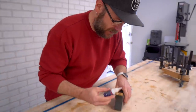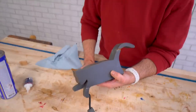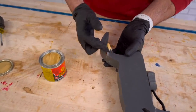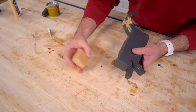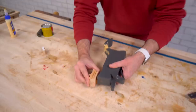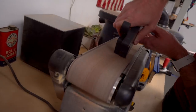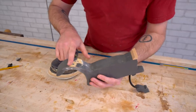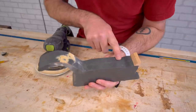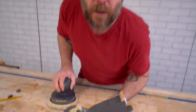I'm noticing I made this out of cherry and then painted it — things were different back in 1992. I'm using plastic wood to fill that in, instead of adding putty that's just going to chip away. So I'm going to sand that down flat and I glued up a block that will glue right in there to cut a new ear — sort of like an ear transplant. Now we're going to sand off some of this wood putty. 25 years ago I did a terrible sanding job; I'll leave all the little flaws in there so mom can remember how bad of a woodworker I used to be.